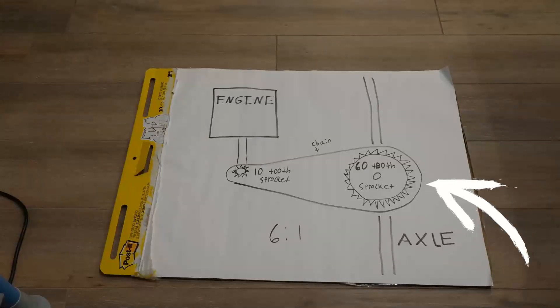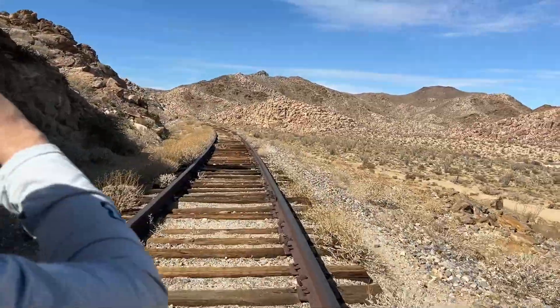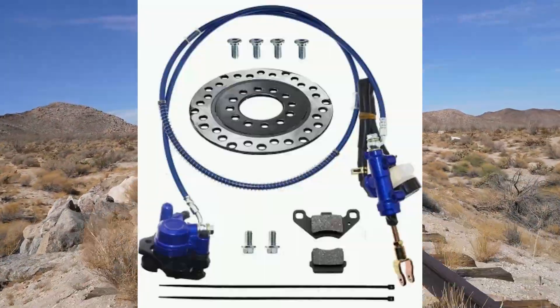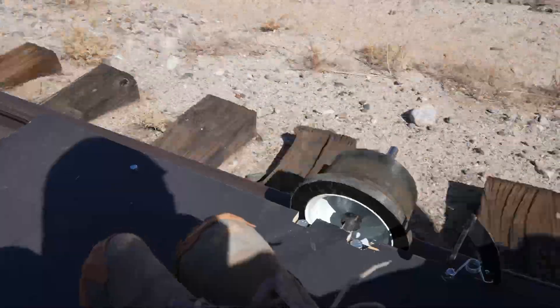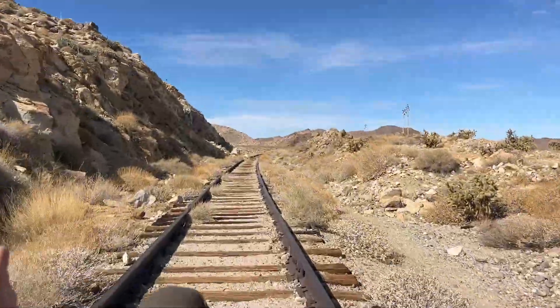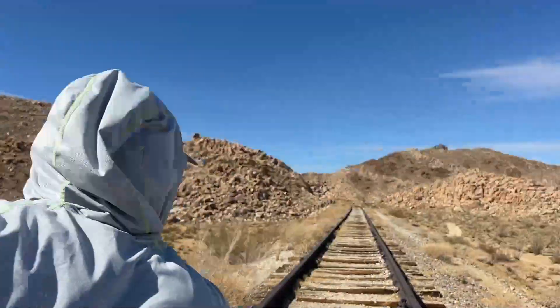In the future, along with my torque converter, I will have a bigger gear on my axle. Another mistake I made was my brake — while what I built worked, it was slow and no better than just using my shoe, and really only good as a parking brake. These tracks are abandoned, and if I'm moving fast and randomly come up on a big rock, I want the ability to stop quickly. In the future I want to add a real brake, like one on a golf cart that can stop me immediately. Another small fix is I will be using locking nuts for everything so nothing rattles off. I'll probably also change to an aluminum top — while it was liftable with two people, it wasn't easy to move around, and overall a lighter build would just be better. Over the next little bit I'll be upgrading and fixing this cart, and you'll see all of that in my future video. I don't know everything, so feel free to share your knowledge in the comments. Thank you so much for watching — if you enjoyed or this video helped you, please consider subscribing.